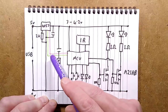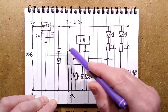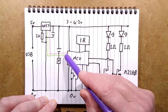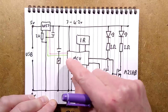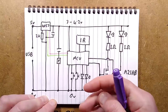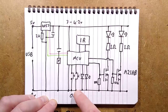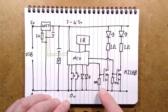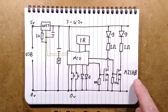These two lines — red and green — are signals from the chip that pull to the zero volt rail. They're pulled up internally to the positive rail by the processor, so it can see the green when charging the lithium cell, and when the output changes to the red line being pulled to zero volts, the microcontroller knows it's charged and changes the LED status accordingly. Two buttons go to the zero volt rail, and two LEDs with no resistors also go to the zero volt rail.